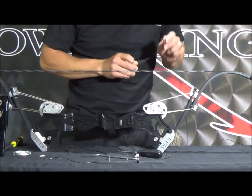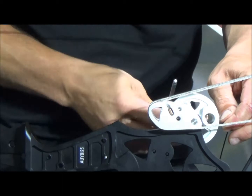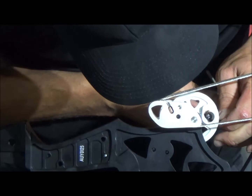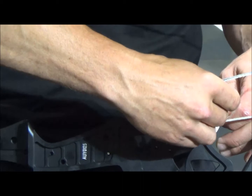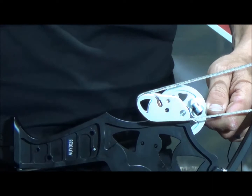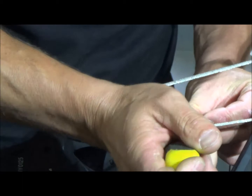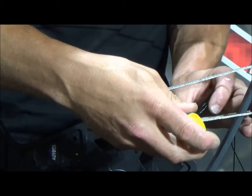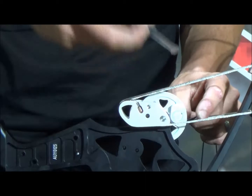Now what we're going to do is reinstall it — basically just redo what we just did. You've got the brass crimp; it's going to go into the timing wheel here. We're going to force it in to that timing wheel, and then using an Allen wrench or something blunt, we're going to force that crimp out of the timing wheel so that you've got about a half inch to three quarters of an inch of cable sticking out. Then grab the tensioner, set the crimp inside the tensioner, and pull the timing cable back out keeping tension on that tensioner. Use a screwdriver to center it up and get everything tightened back up. Rotate this back and forth and make sure these timing cables are moving in and out — if they are, you've got it set right. If they don't move, it's bound up in there and you need to take it back out, get it centered back up so that it will move back and forth.